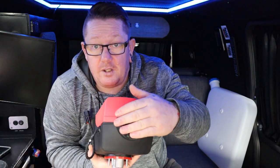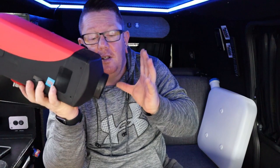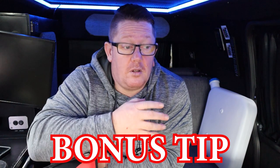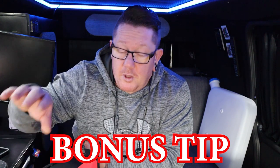Make sure it's got a vent to go outside, make sure it can pull air from the back of the unit straight through to the front — this is where the heat's coming out and where the oxygen is going in. Make sure the unit can pull enough fresh oxygen from outside the van. Also, you're going to cut down on 99% of your condensation because you're pulling in fresh air — the fresh air comes into the unit and it pumps out warm, dry air. The dry heat will solve the problem of all the moisture in the van and you won't get damp.